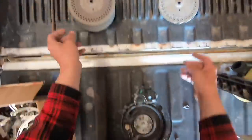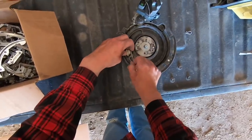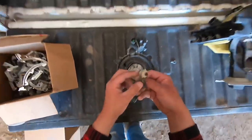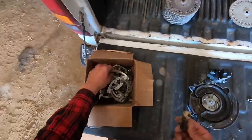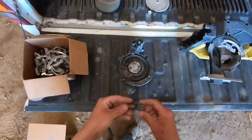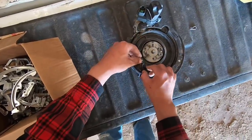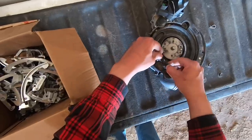So that's one difference. We're gonna take this knockout wheel out. All you gotta do is pinch it and unlatch it just like that, and it comes out. And you wanna put the soybean knockout wheel in that has 2 rows of spikes on it. So just get it started in there and get it to rest on the spring.